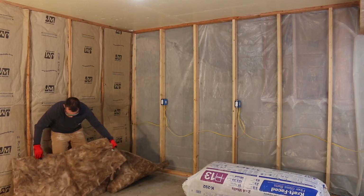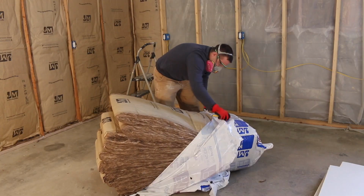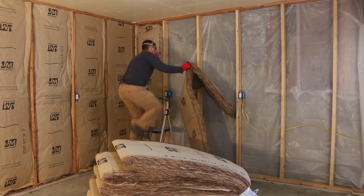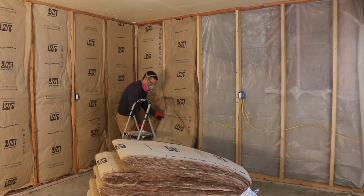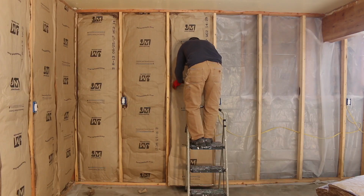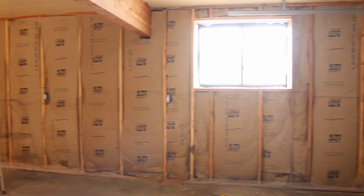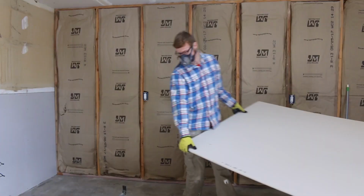The insulation came in sheets that fit the space perfectly without having to cut it. I used R13 fiberglass bats, which are meant for 2x4 walls, and they were pre-cut to 23 inches wide and 93 inches tall. Now, the insulation went up quickly and was really easy to install, and I worked around the entire wall and made cuts with a long utility knife around outlets and to make the insulation fit in the smaller spaces around windows. Once the insulation was complete, we started sheeting the walls.